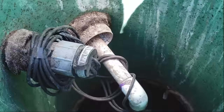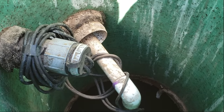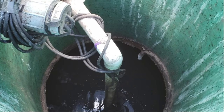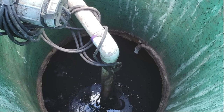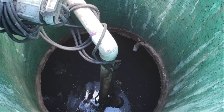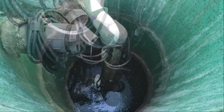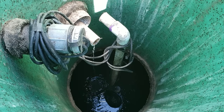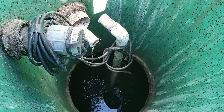When I opened it up, this is what I saw. Basically the pump is at the end of that PVC pipe, and that PVC pipe comes up, turns 90 degrees, and goes out to my mound. They didn't even give me a junction — that was kind of disappointing. But regardless, we were able to work with it. I had to cut the pipe and leave enough PVC in each part so that I could put a coupler in there.